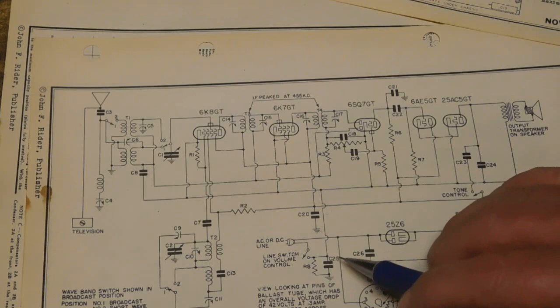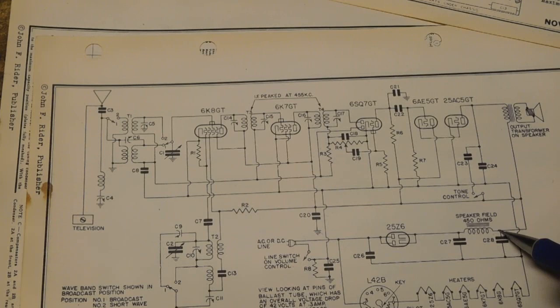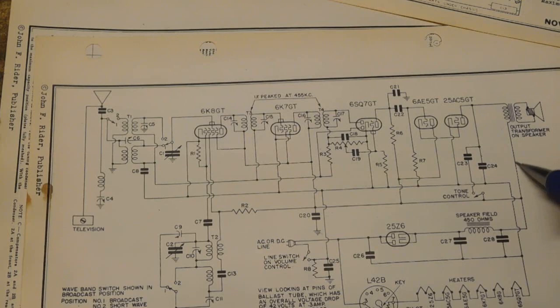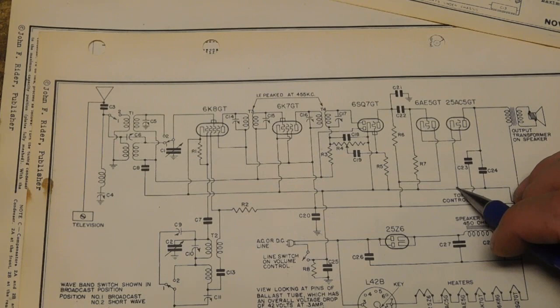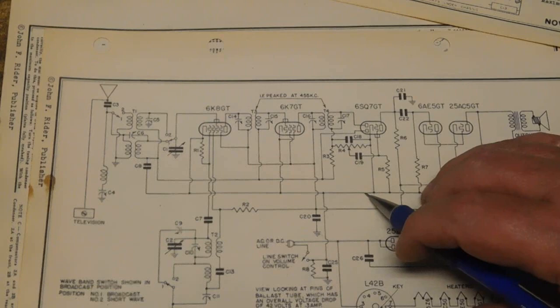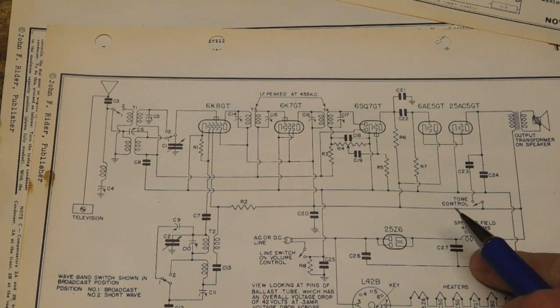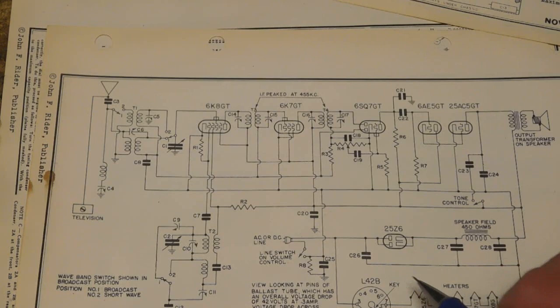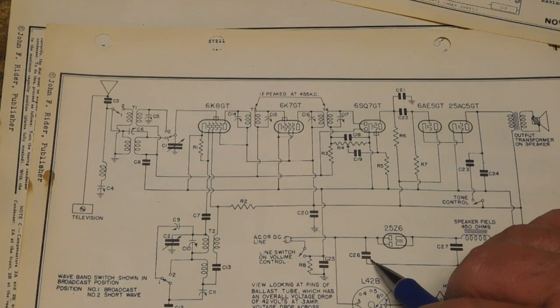As far as pathway, again, we come through the tube, the positive going wave, through our rectifier, through a filter, and then feed out through this line here and up through here for our various plate circuits and B+. Return path, well, we follow down our cathodes there, and we'll find that return path comes back, following this line here, and it comes back down. We see that our negative sides, now these are very poorly done capacitor symbols, come back, and there's another part here where it actually feeds back through here to the switch. This is a suppression cap here, noise suppression.